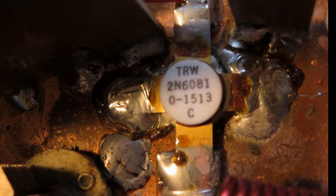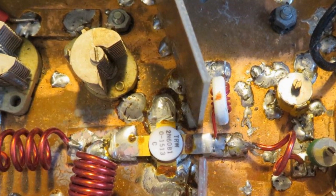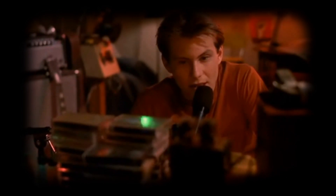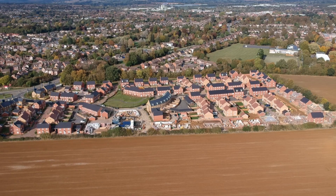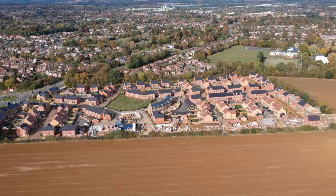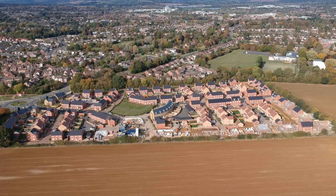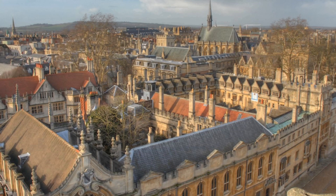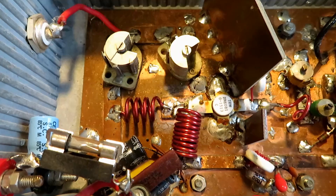The next day I was super excited because the power transistor had arrived. I had ordered it at a price of £15, which seemed super expensive to me. This was really the heart of the beast - without this Dave wouldn't have a chance. The low end stage before the pre-amplifier mixer was about 1 watt, probably not even that. The output power of the radio was going to be roughly 15 watts, and with the right location I had already seen from my visits with the other guys that they could get a range of over 20 miles. The group I watched could easily get into the near city of Oxford on a good day, which was 25 miles as the crow flew. Pretty impressive.